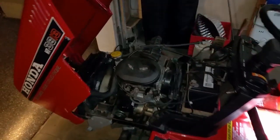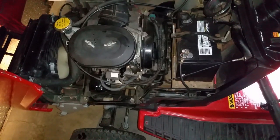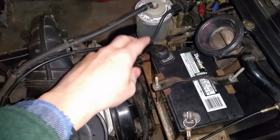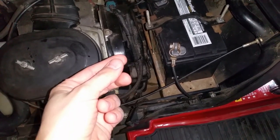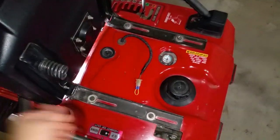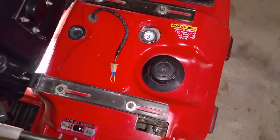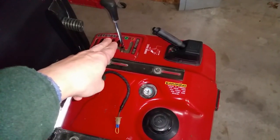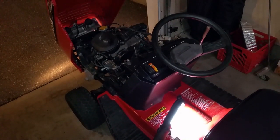All right guys, here's the final result. Got the engine running and everything put back together. Bled out the air in the radiator system, the timing belt and water pump have been changed with no leaks, and had to clean up the electronics pretty well — this sat outside for about a year and had a lot of fine dust inside the relays. I had the ignition coil air gap too big, and I was also having problems with the kill wire still killing the ignition. I did have to bypass the seat switch since they no longer make them — this will prevent it from shutting down the engine when you get off the seat. Not the ideal situation, but it's the best way to get it going. Parking brake has been adjusted and the clutch mechanism has been cleaned up too. Thanks everyone for watching — on to the next machine. Have a good one, guys. Cheers.